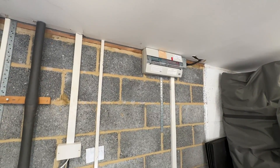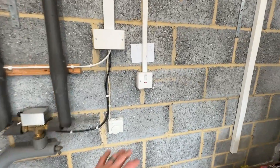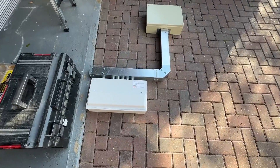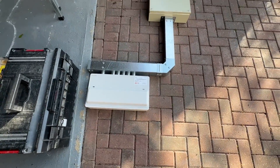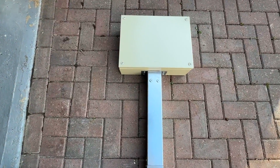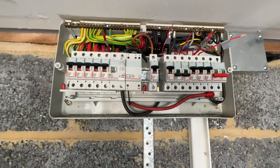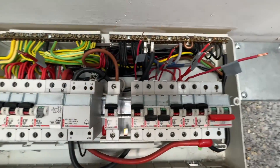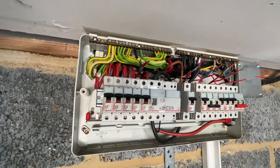This is this morning's job: we're taking this fuse board out, a new fuse board is going in. The old board is being replaced with a junction box and the new board is coming down a bit lower, around about this height here. This is the board that's going in — on another video you might see me making this, but I had some dimensions for the job so I've pre-made this back at my place. Hopefully it will just lift up and take the place of the existing fuse box, then trunk down to the new one. This one's stripped out at the moment. I'm labeling up the cables as I go, giving them the same number reference I had on the original board, so it just makes it easier to put it back together later.